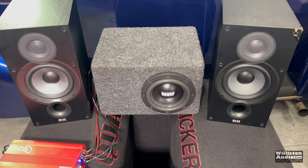I demoed some other songs off camera that I can't play back for you. Overall I was really happy with the sound quality of this amp. Let's check out the thermals and internals. The outside of the amp — the bottom is the hottest part, a little under 100 degrees Fahrenheit after jamming for a while. We took off the bottom plate to check thermals inside, and scrolling across we got almost 200 degrees Fahrenheit with some of the resistors, but nothing out of the ordinary. These are the internals — this is a Class D four-channel full bridge amp; Alpine, Kicker, Rockford, and a lot of other companies have used full bridge designs over the years. We can see 35V 2200 µF for the filtering, and 1000 µF 50V for the rails.